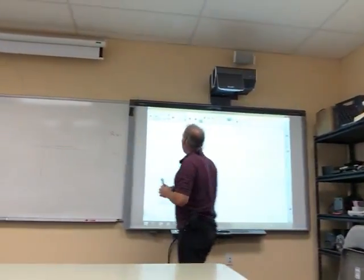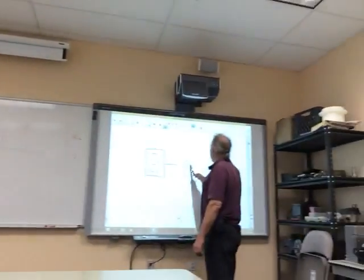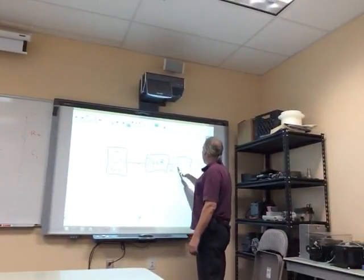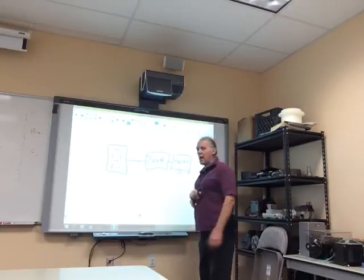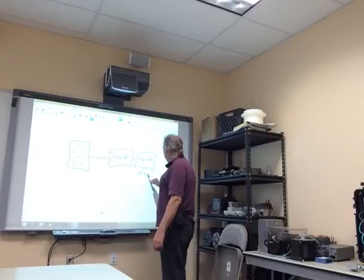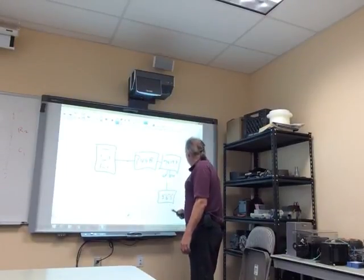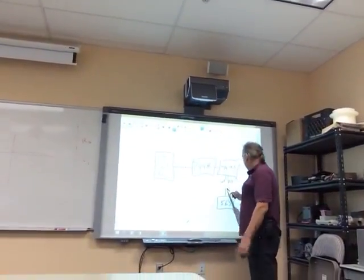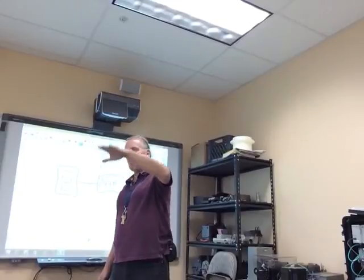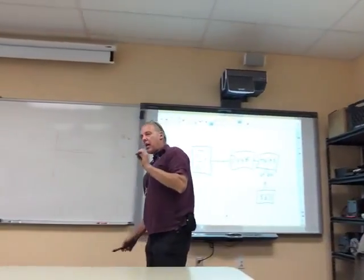Okay. So to look at what we did, we have our display. We have a 7448 that drives our display. We have a 74193. That just has an up and a down count. That's all we have to worry about once we get it all wired up correctly, right? The up or the down. And we have a 555, and it should be pulsing at some frequency that's slow enough so we can see it count. And we can attach that to the up or down. If we have a little pot on it, we can change the frequency a little bit, and it should count up. If I put it on the down, it should count down. Right. So that should be where you're at. If you're not, that's okay, because I know there were some issues and problems.